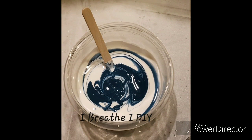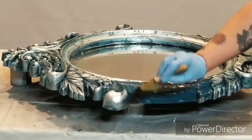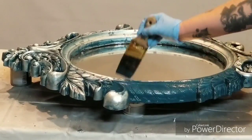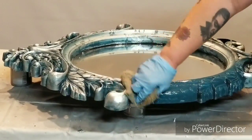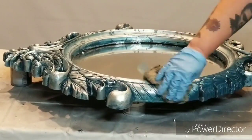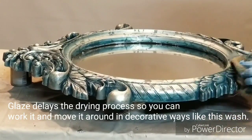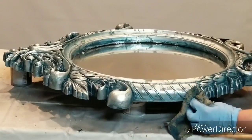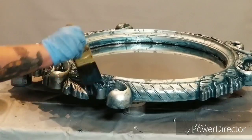For our wash we've mixed half glaze and half a beautiful blue color to give it some really high drama. I'd already finished this step and didn't realize my camera had turned off, so I apologize — I had to go back and repaint this for you guys. What I did was coat the entire surface with this mixture of glaze and paint, which keeps it very liquid so it can be moved around. We'll paint the entire surface as well as all of the crevices, pushing the brush down into the holes, and then go through with a clean damp rag and gently wipe the top of the surface off. It's a lot easier if you fold your rag in half so you can fold it again to get a clean surface.